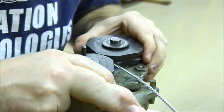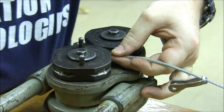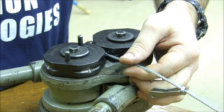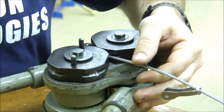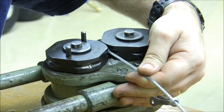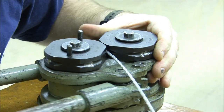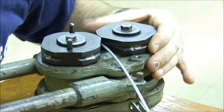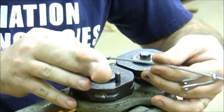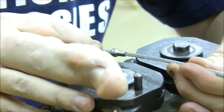I'm going to tighten that up as tight as I can by hand. Since I don't have a guide, I've got to hold it straight by hand, which is real interesting. And we are going to go ahead and tighten our first swage — come across once, twice, and that pulls it through. We've made one pass. That one pass did a partial compression on the ball, and it did more of a compression on the shank.